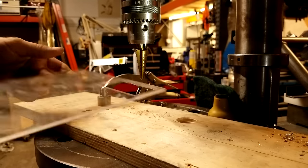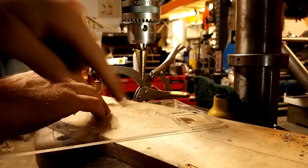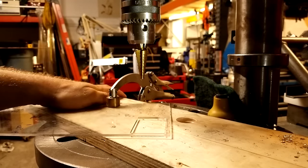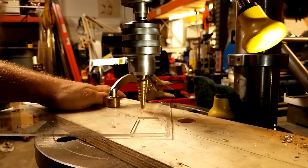Let's drill a big hole in this piece of plastic using the step drill. Keep in mind I have this supported underneath with plywood, so we're going to have to drill through the plywood as well. Same with these — keep the RPMs low.